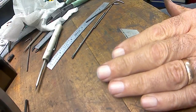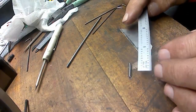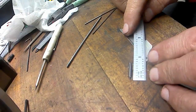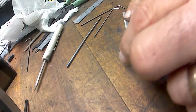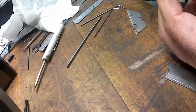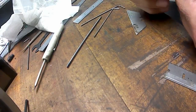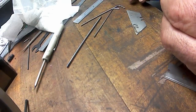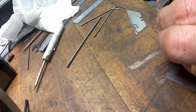Right here is where I want to be. I got the first loop and I'm going to measure over approximately about 700 thousandths from the center line. Actually the spring is going to be about just the right length if I trim the end off and fold it down - I thought it would look extra long when I was winding it but apparently not. I'm going to trim off this tab on the end here, get it as short as I can.